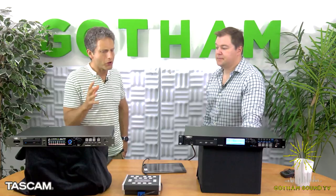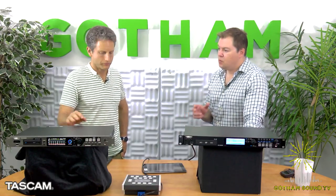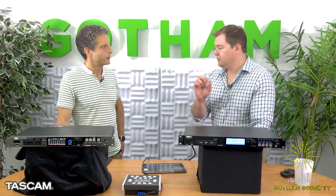High reliability events requiring absolute fail-safe performance. Along those lines, you've done something interesting with the media. It uses an SSD drive, but we developed our own. We test media on all our recorders — you can go to our website and see which SanDisk cards are approved. But on SSD drives, we found one batch would be okay, and then the next batch they'd change a controller chip and it wouldn't be okay anymore.